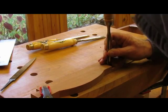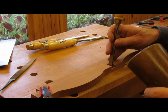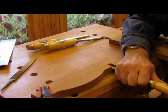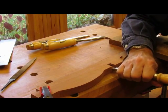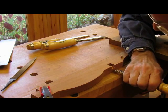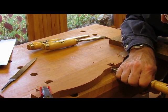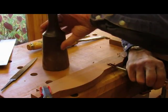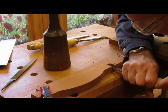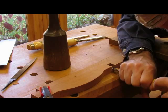It's a simple half-blind dovetail, and I want it to fit really tight with no gap on the face. So I cut it a little bit smaller, then I'll pare off the sides and the bottom to hopefully get exactly the right amount, and it'll fit in there nice and tight with no gap.